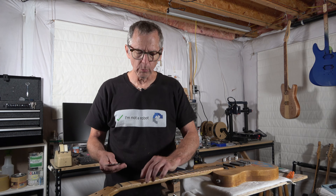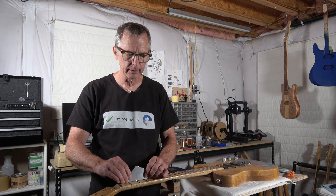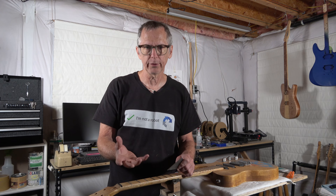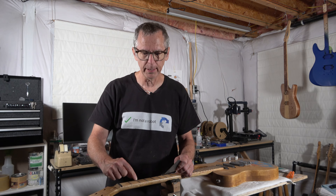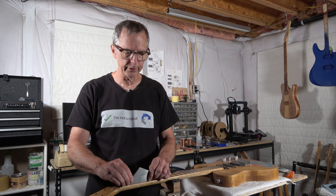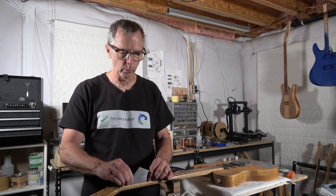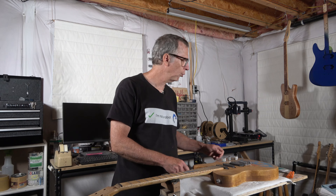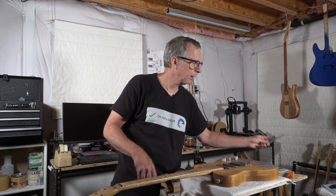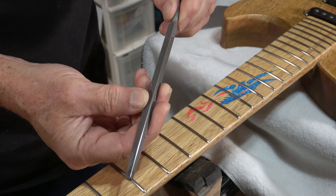So what we're doing is we're looking for that high spot. And once we've identified a high spot, you can mark it with a Sharpie. If you've never done this sort of work before, using a Sharpie will help you to see exactly where your high spot is. Otherwise, once you've got experience doing it, you can pretty well see where that high spot is going to be just by where the rocker is rocking and where it's not. But once you've identified where a high spot is, you can take a tool such as a file — I've got a three-corner file here that I use quite a bit — and you can use that to take down that high spot.